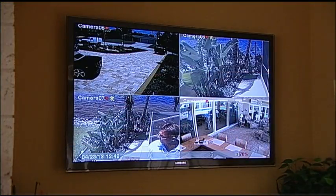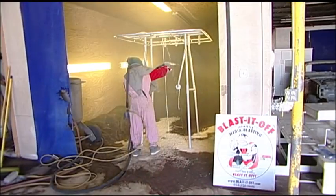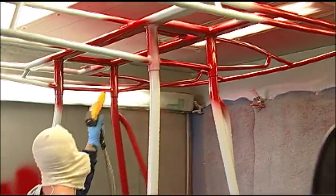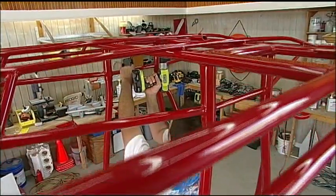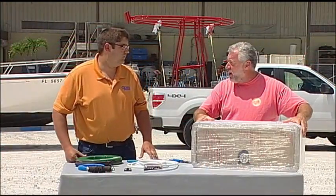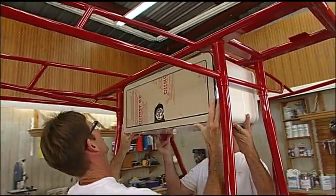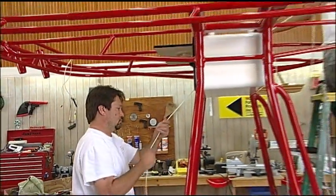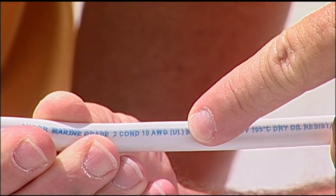What we have to do is — remember, I had to pull all of the original wire from the T-top off prior to it getting sandblasted and then powder-coated. Now I have to run some new wire down. What gauge of wire should we run from our battery up through the T-top? You should always stick to a marine-grade copper-tin. We've chosen 10-2 for this length of run. The thickness is dictated by an organization called ABYC — the American Boat and Yacht Council — a governing body that oversees boat builders, making sure they're building boats safely for consumers. We're going to have to connect this 10-2 wire to the battery.